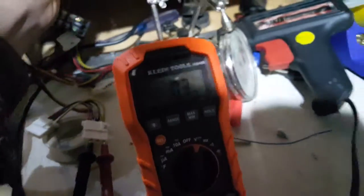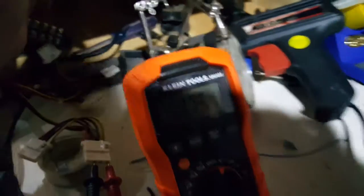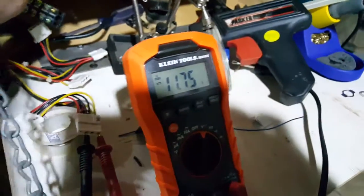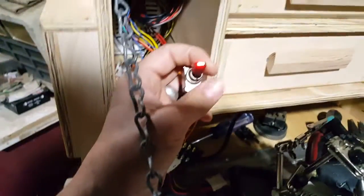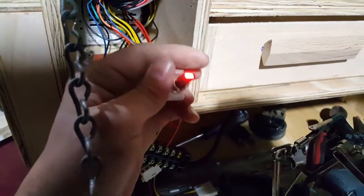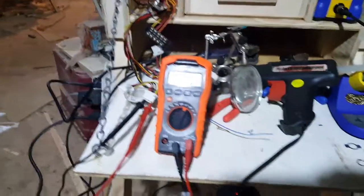Now when I turn on the switch — there we go — we've got 12 volts on startup: 11.75, and it'll actually get to 12.47 under a load. My little LED lights up, so happily I've come across a solution that will work out pretty well.